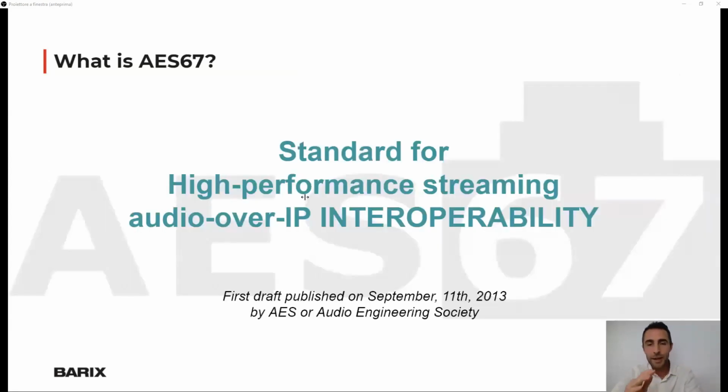And going forward, the meaning, the definition of AES67 is exactly this. If you look at the standard itself, this is the title of the standard: a technical standard for high performance streaming audio over IP interoperability, where interoperability is the key term to keep in mind in this presentation. AES67 is a technical standard and is a conglomerate of multiple technologies and protocols. It was released back in 2013, and after that, it saw two minor updates, one in 2015 to clarify some patent issues, and the other one in 2018, where some annexes and more recommendations were added, and the performance test compliance statement was also added.